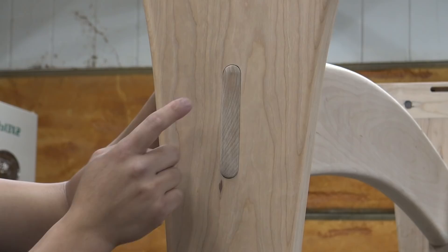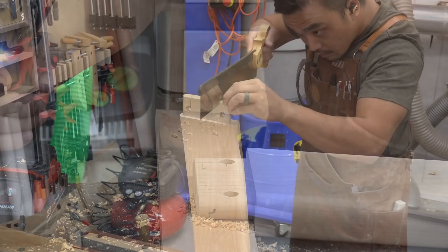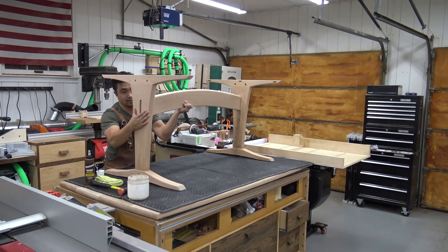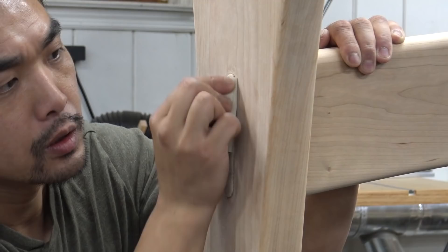The last thing to do before applying finish is to attach the stretcher to the trestle table leg assemblies with wedged through tenons. The walnut wedges were made on the bandsaw using a jig. I then drilled half-inch strain relief holes and cut saw kerfs into the tenons using my carcass saw — the strain relief holes ensure the tenon doesn't split past the hole once the wedges are driven in. Once the stretcher is installed and held with clamps, I drive in the wedges, cut them flush with a flush-trim saw, and do some final shaping with a sanding block and my Rotex 90 with a soft interface pad.